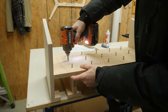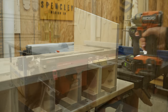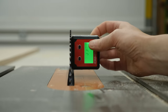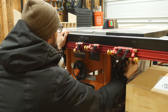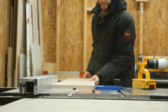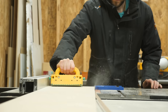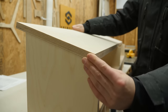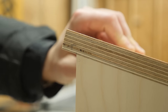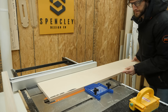With the center shelves attached, I can go back and get all those T-sections screwed back in place before I cut down the top shelf. The top shelf is going to have a 15 degree bevel to match the 15 degree cut on the sides. And because the scale on most table saws is useless, I use a digital angle gauge to dial in the perfect setting. When doing beveled cuts like this, I like to use my Kreg featherboard to hold my pieces firmly against the fence, then take the piece back to my project to mark out exactly where I need to cut it to fit. Referencing your work piece is going to be way more accurate than any tape measure.